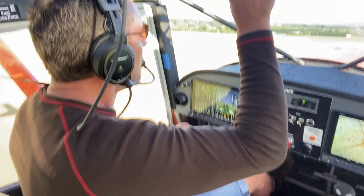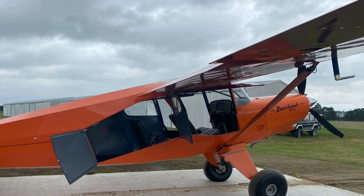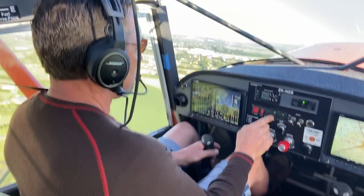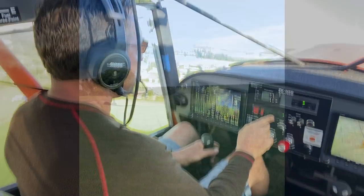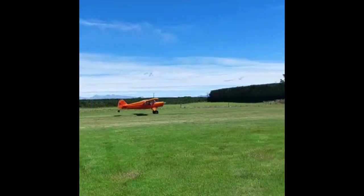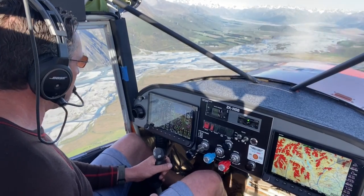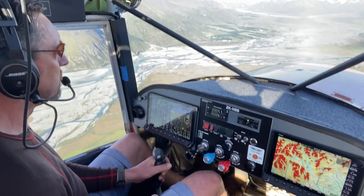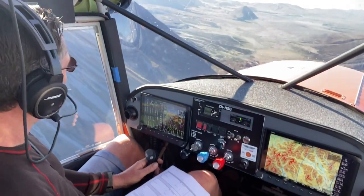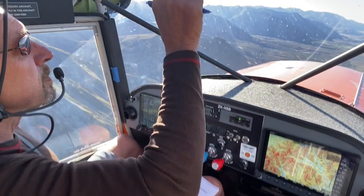After a couple of flights seeing that behaviour repeat itself, we went back and decided to check all of the rigging throughout the whole aircraft. That started with checking the tyres were inflated to the same amount — we immediately noticed the right wing was slightly low on the ground. So we took the engine cowling off, hoisted the nose of the aircraft up by the engine mounts, corrected the oleo struts, and once we got it sitting level with the correct track distance, the wings were level. We checked that with an inclinometer and proceeded to check the flaps.